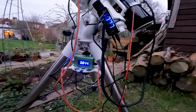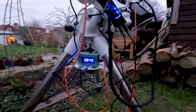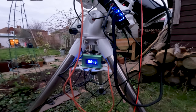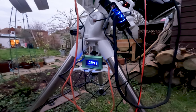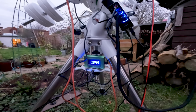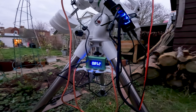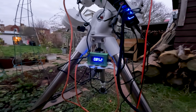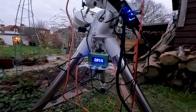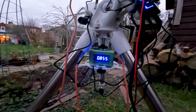Looking at it - it jumped up quite a bit at one point which we don't want, showing a bit of binding. Carrying on slewing in that direction - we're back to 8.4, that looks good. Slewing the other way - we're at 8.4, and there was no jump there where we had that big spike to 9. 8.5 - I'm happy with that, that looks nice and quite stable. It's gone up a teeny bit to 8.53, 8.55, but I'm quite happy with those numbers - they're pretty stable. And the RA feels a lot more - literally the play has gone out of it.